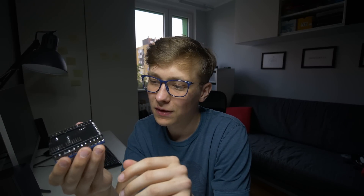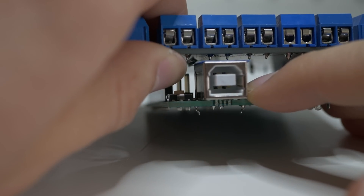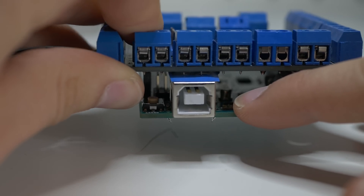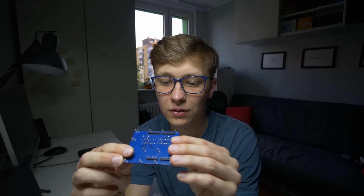Another thing: I cut the legs of each screw terminal, which is good because they are quite long. But there is still a problem — when you connect the shield to the Arduino Uno, the Y-axis endstop connectors touch the case of the USB socket, which definitely shouldn't happen. So I'll put a piece of tape on the Arduino Uno right on the USB socket, and that should be fine. This happens because I used normal gold pins; there is actually a version with longer pins and headers on top that are meant for Arduino shields — I've already ordered those.